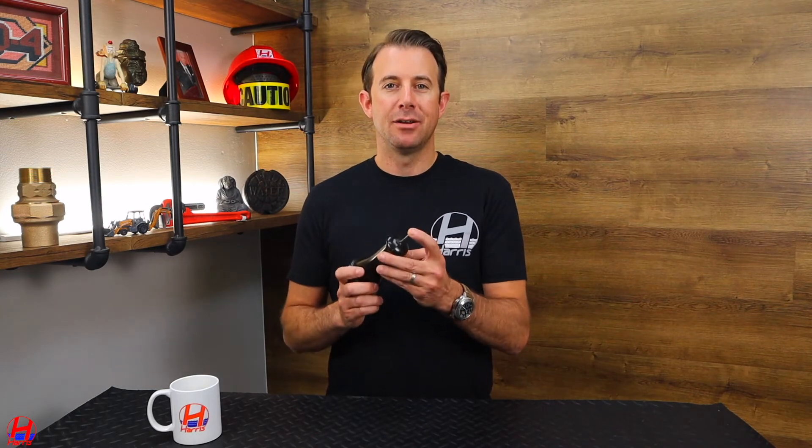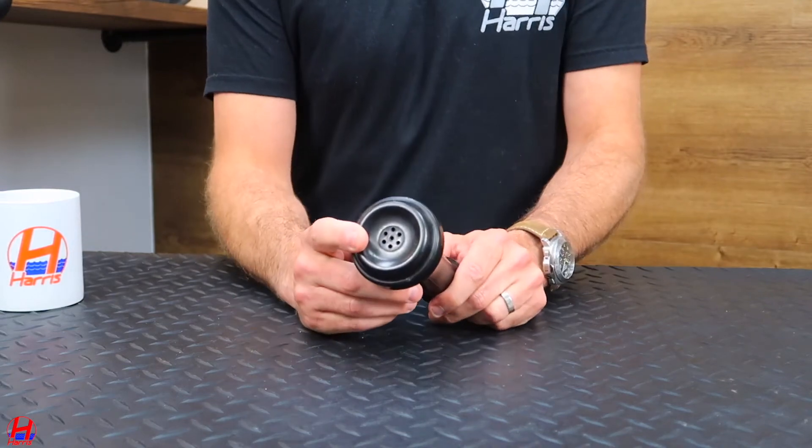This can be done by shutting off your main house control valve. If the main shutoff valve looks extremely old or not in good working condition, it may be advised not to work that valve. Instead, make sure all fixtures in the house are not running — no water running anywhere in your home. At that point, take the metal end of the sonoscope and put it to the water main and your ear to the earpiece. If your water main is not leaking, you should hear nothing — completely silent. If you do hear noise, it's a clear indication that your line is leaking.